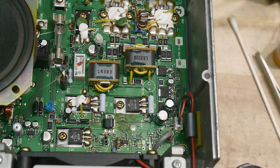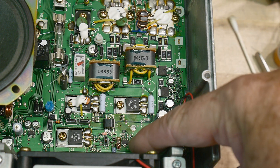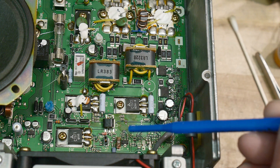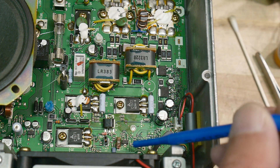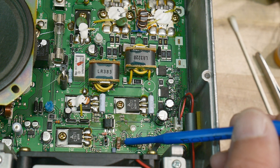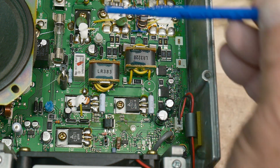This is downstream. So the way this works is there's a single-chip driver down this way. Let me get something to point with instead of my big fat fingers. So the signal comes in with this coax here, and it comes into a pad, and it goes into this transistor right here, which is the first. Then it goes through this transistor, which bumps it up. And then it goes through this pair, and that pair drives this pair.